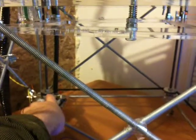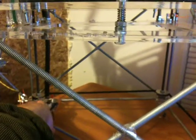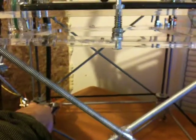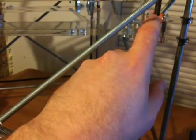For those having trouble getting your Z-axis, remove the bolt from the bottom of this pulley, and that will lower this down. Because normally it would sit above the motor and it would pull out. Super glue everything so that you don't have any slippage. And then one nut instead of two right here — put this one up at the top — and you should be able to get your table to work.